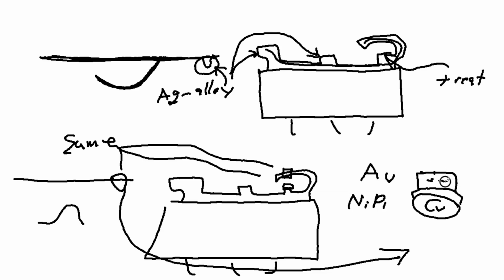So in the case of the Japanese Omrons, that's probably going to be a copper material with probably nickel plating and then gold on top of that, or a gold alloy. And then in one of the super fancy switches, it'll switch down to the tiny little microamps ranges. It'll probably be a copper alloy with a nickel coating on top of that, a nickel palladium coating on top of that, and then you'll have probably a gold alloy or pure gold with some kind of embedded nanoparticles or oxides. Usually that's going to be aluminum or platinum.